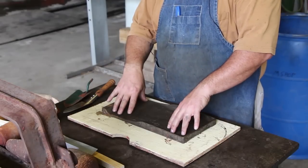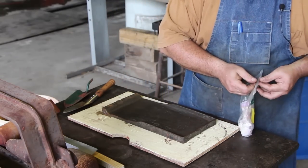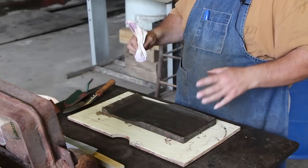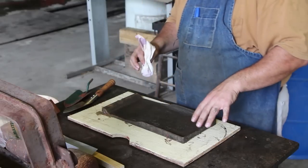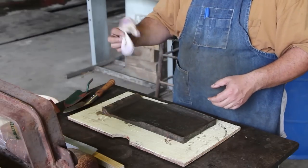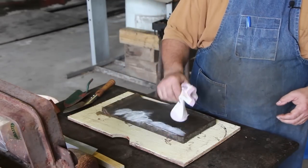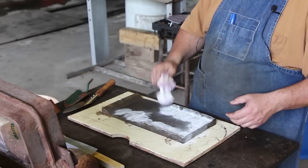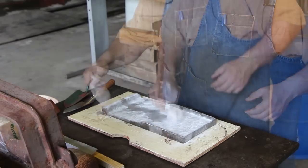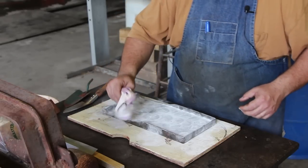First thing I've done is I've got the part I'm working on laying on a piece of plywood here. And we're going to come in here with some parting dust, which is usually nothing more than just some talc powder — I've even used baby powder, it works. It's just a powder to put between whatever you're working on and the sand. It gives a parting layer so that the sand does not stick to whatever you're working on. I've got it in a little baby sock here and we're just going to cover our part with this. This helps keep the molding sand from sticking and will help release the part from the mold a little bit easier. I'm also going to put some around on the plywood itself because the sand will be down there and it will help it separate.